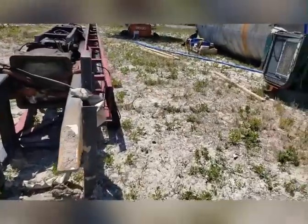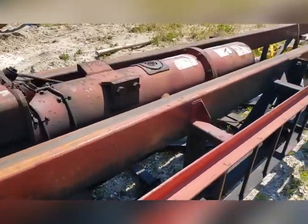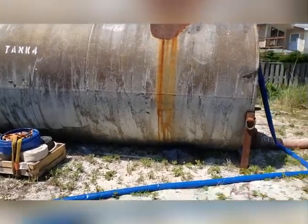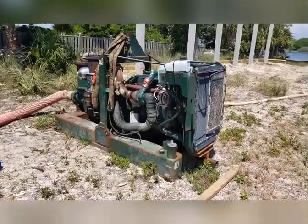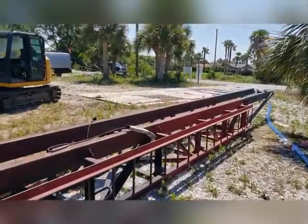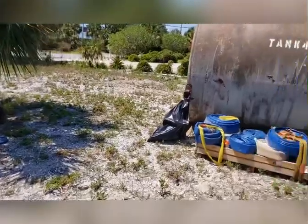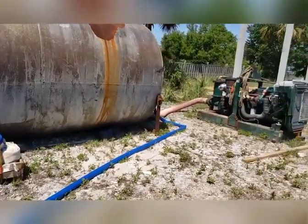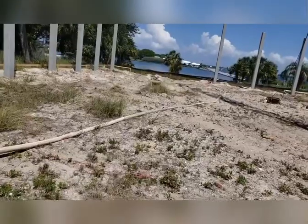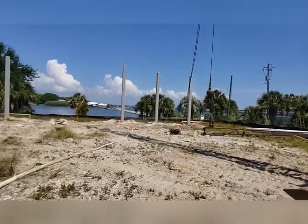Parts used for installing piling: this right here is a diesel hammer. It's got hydraulics in it, which enables it to develop an enormous amount of hitting power. Also used on the project is a big water tank and a giant diesel-powered pump. This blue hose on the ground runs out to the fire hydrant you can see in the distance. We have a special device called a hydrant meter. We jet water from the hydrant into this tank, which acts as a large reservoir, then use the diesel pump to suck the water out into another hose — kind of like a fire hose. We lift it up with the crane adjacent to the piling and use it to push the piling into the ground for the first set.